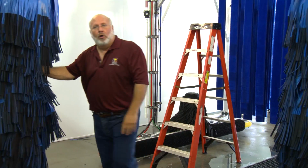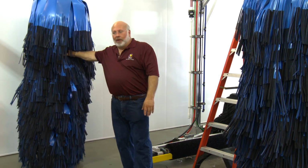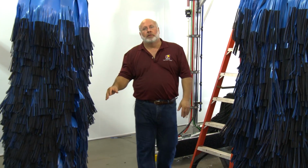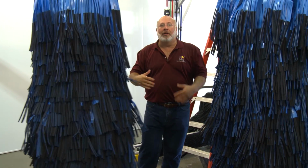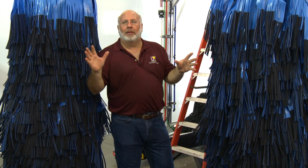If they weren't coming home, the first thing we want to do is check to make sure all of our air is exhausted. The regulators we use are exhausting regulators. If you happen to have a service problem and you change them, you want an exhausting regulator. So as soon as you switch the flow, the air should exhaust completely, and it lets it work basically on its own.